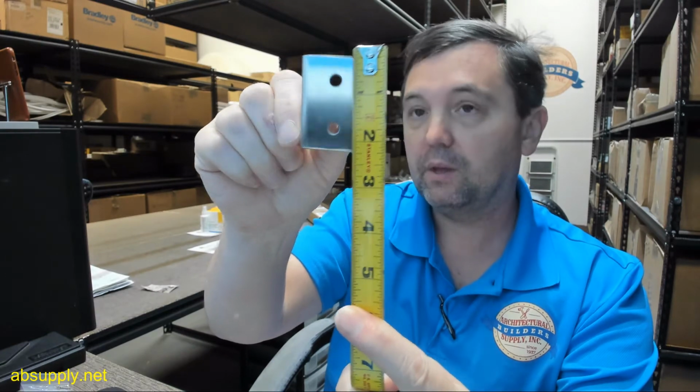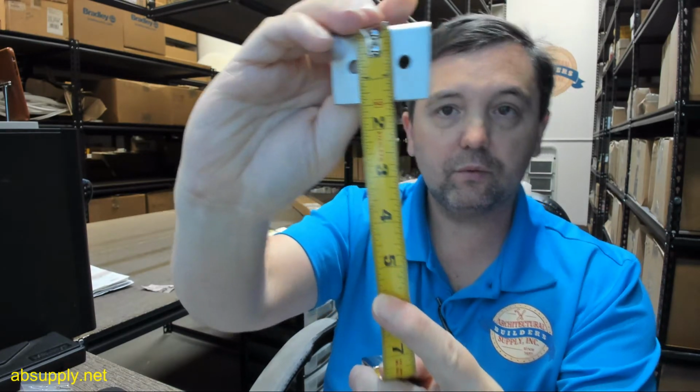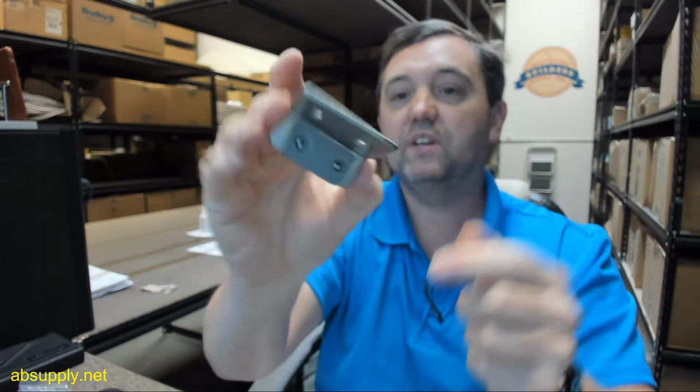Let's go over the dimensional properties of the angle strike, the 1217S. There is a link below this video to a document called Template that will allow us to review the dimensional properties of the item. It's 2-inch overall width. It has an overall depth of 1.5 inches. Has an overall height of 7/8, at least to the metal itself. And that piece of rubber that's in there is riveted down.